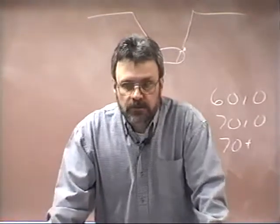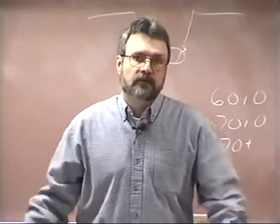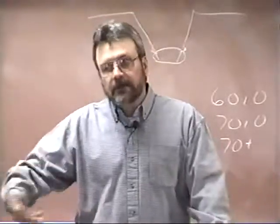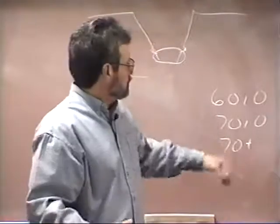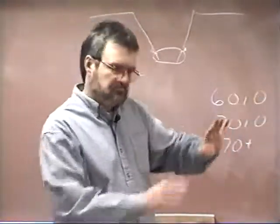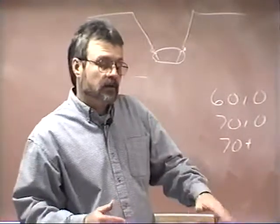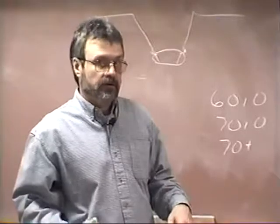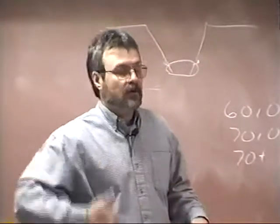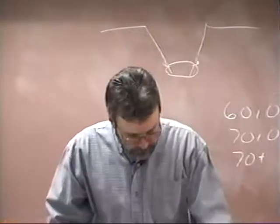Most welding procedures will say that it has to be 70 degrees or 55 degrees, something like that. You've got to drive out the moisture. And it depends on the type of steel you're using. If it's X42, that doesn't have a high tensile strength. X65, very high tensile strength. So you're going to want to maintain about a 200 degree temperature to that pipe all the time for every weld that you're going to put in there so that you don't get cracking afterwards.